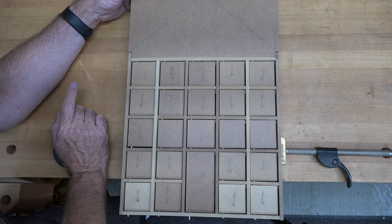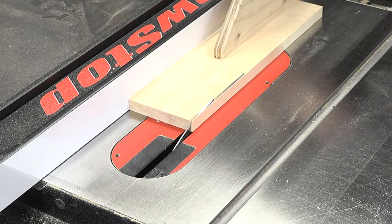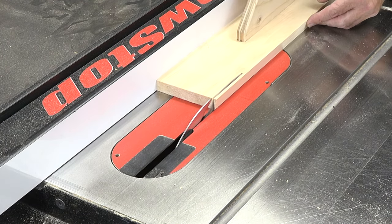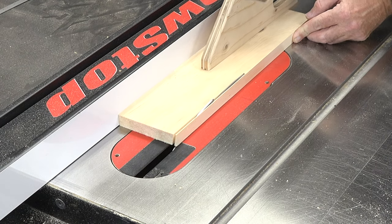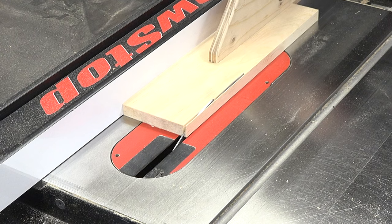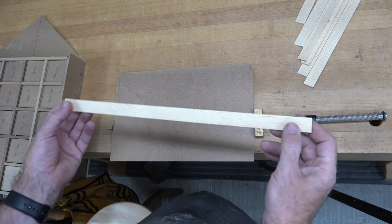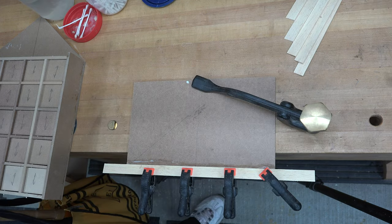For the next parts, I've tilted my table saw blade to 10 degrees and made a pass along the length of the three-quarter inch thick pine. From there I've straightened it back to 90 degrees and ripped that piece off, then changed it back to 10 degrees, back to 90, and kept cutting until I got a bunch of these pieces. They will end up being the clapboard that goes on the front of the house at the roof section.